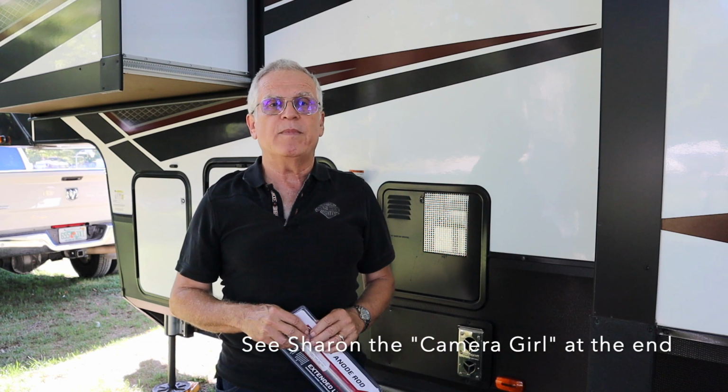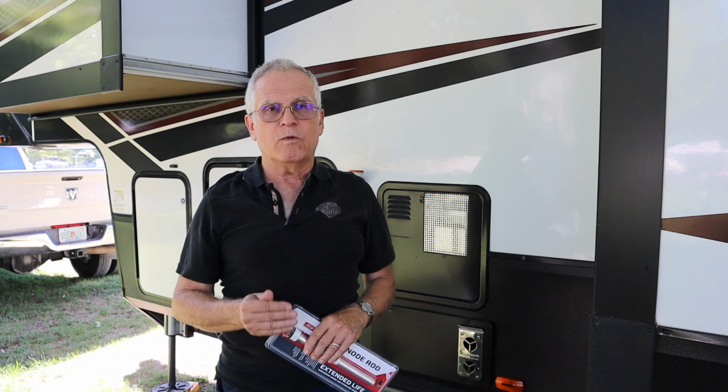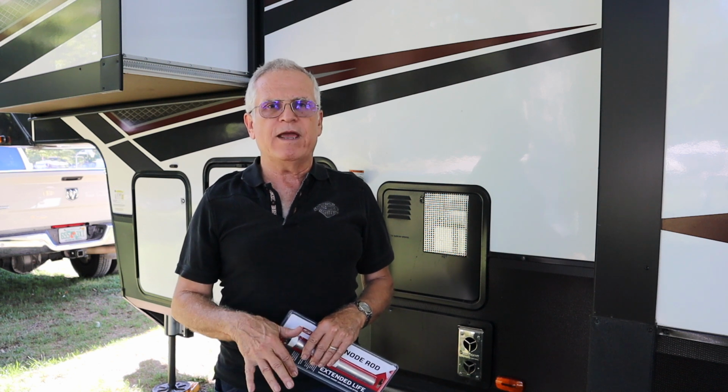Sharon is behind the camera today, and today we're going to be talking about changing out the anode in your water heater. This is only for people who have Suburban water heaters. It is not the Atwood heater. So if you have an Atwood, this doesn't apply to you because Atwood water heaters do not have anodes.